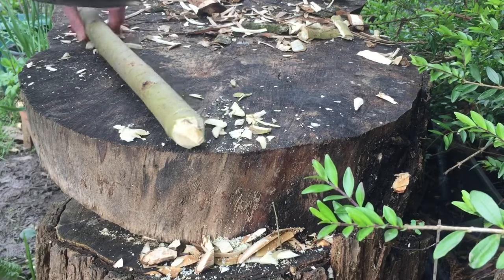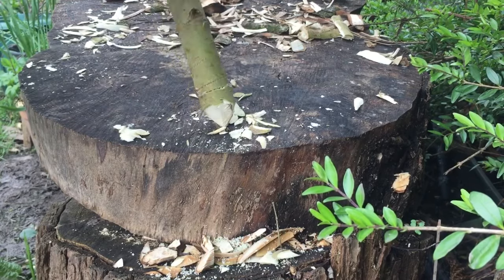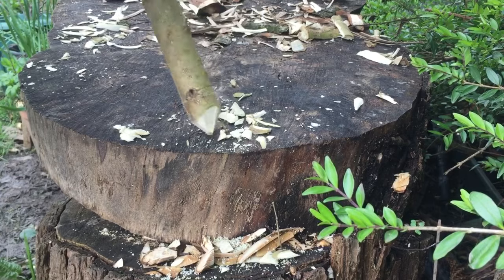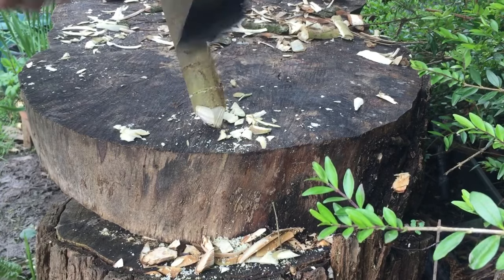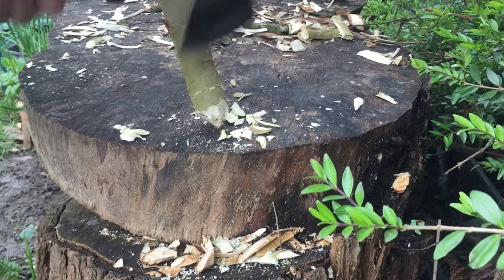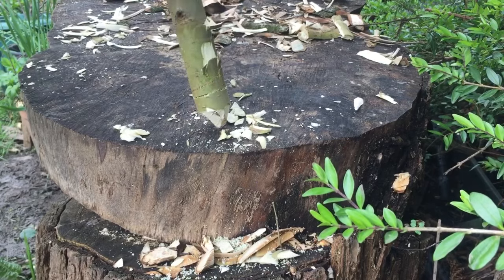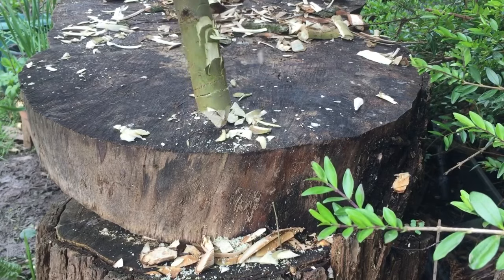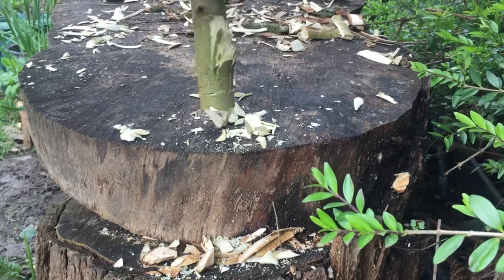This is a really sharp little axe, so it's great for roughing out the shapes of things I want to carve. I'm making lots of little cuts just down the length of the branch, and this means that when I come to chop down some slices they'll come off nice and smoothly and the axe won't get stuck and split the wood. Just a few little chops in and then you can take off a nice thick slice of wood.